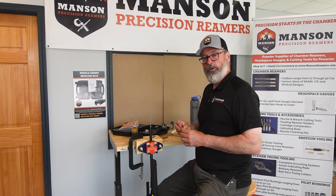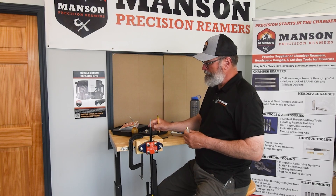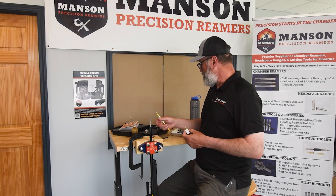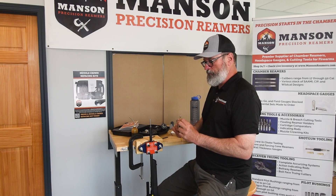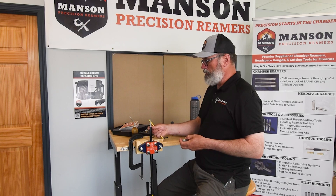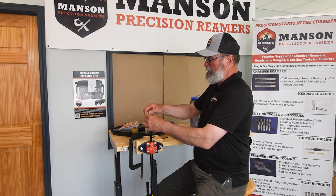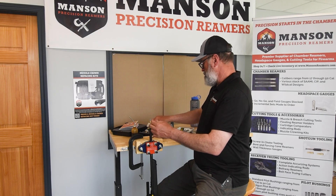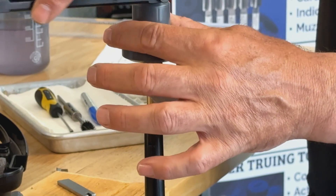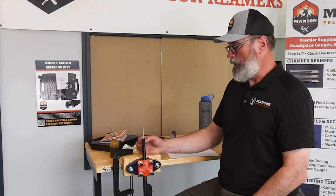I'm going to show you how to use the 45 degree outside chamfer tool. It's not part of the regular kit, but it's probably one of the most bought add-ons — it's for cutting around the outside edge on this barrel. We didn't cut the original crown completely off; if we had, and it had come to a square edge on the barrel, that square edge would have been quite sharp. You could use a little emery cloth if you wanted to, but this makes pretty quick work of it. We removed the front sight so it does not interfere, and basically you're going to run this just like the other cutters. A little bit of elbow grease and we've got a brand new crown on our rifle.